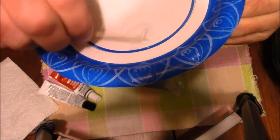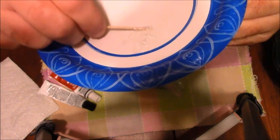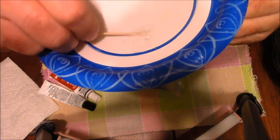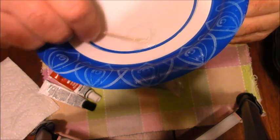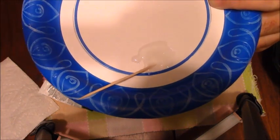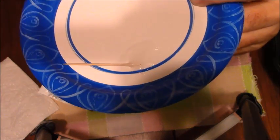And we actually had failures occur, adhesion failures, for that very reason, on some very expensive devices that cost us a few $100,000 in delays and rework at the company I worked for. All right, so we're going to mix. And one of the corrective actions for that failure was we specified a length of time that the operator had to mix this stuff. We said, do not mix that for less than 60 straight seconds.